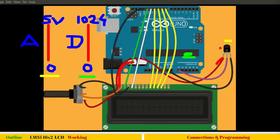So let's go through this once again. Suppose our temperature sensor reads a value, and say that value corresponds to 1 volt. So it will be somewhere here in the analog scale. The analog to digital converter inside the microcontroller will convert this 1 volt to some number of samples in digital. Out of 1024 samples, 1 volt will be somewhere around 200, because if you calibrate likewise it will be around 200. Similarly, 2.5 volts somewhere here will correspond to 512 samples. So the digital samples correspond linearly to the analog voltage.